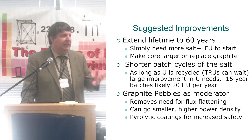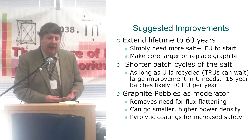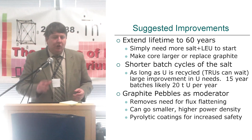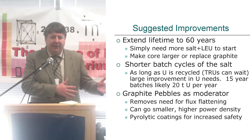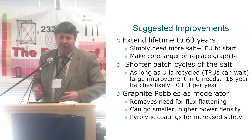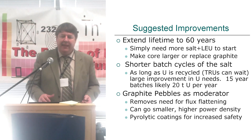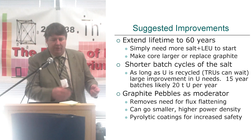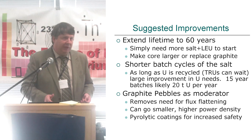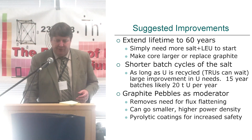Some of the things I've been working on — because they didn't really do much optimization of this — is, well, we probably want to go to much longer than 30-year lifetime: 60 years. We can make the core a little larger and still get that without replacing the graphite. Shorter batch cycles — regardless of what you do to the graphite, going to shorter cycles is probably nice. The salt, even if we're sending it to waste, ideally take the uranium out. That's simple and cost-effective. There's a lot of value in there. If we do just two 15-year cycles, or four in 60 years, we can drop that annual use — because fission products aren't building up as much — down to probably 20 tons of uranium.